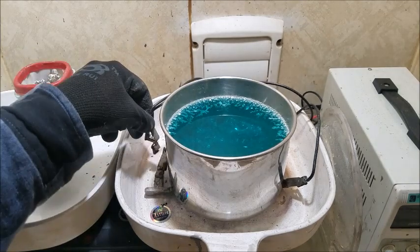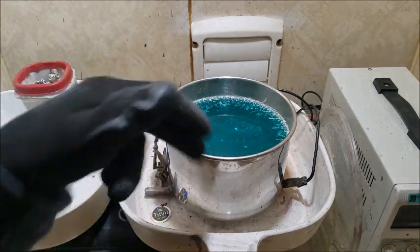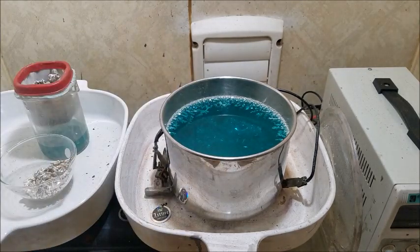So I'm going to pour this off. We're going to wash the silver that we have. We're going to make new electrolyte, and we're going to start a fresh batch, run all the crystal through that we have, plus this stuff. Yeah, we're going to make it work. But I was really hoping to start the next round with just pure crystal.